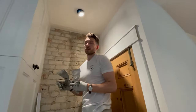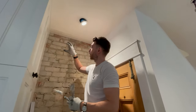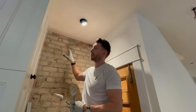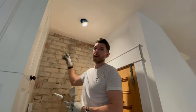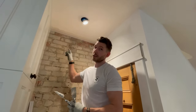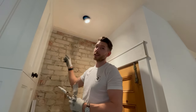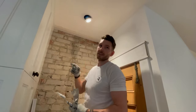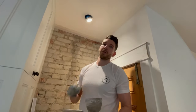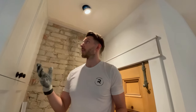When that mud cures and hardens up, you have a really solid edge where you got drywall meeting something that isn't drywall. That happens all the time and this is a really easy way to use whatever beads you have lying around to solve that problem. This is also the moment when you realize why Trimtex makes a tearaway bead and how good it is, but in a pinch it's a solution for you. If you want to see how to use the actual tearaway bead, we have that video up on our YouTube page right now — they also make a lot of other specialty beads that get you out of jams all the time.